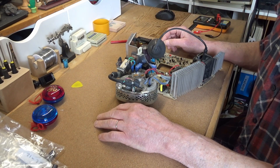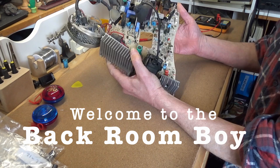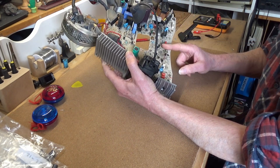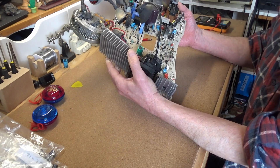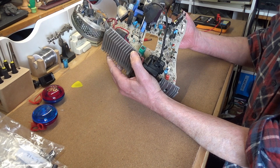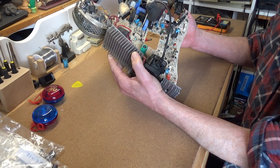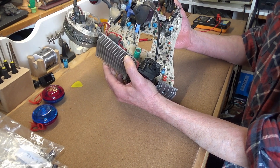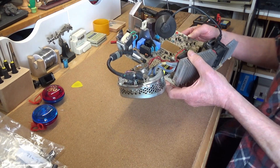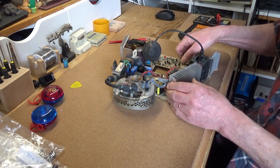Hello everyone and welcome to the back room. The last time you saw this G3, I had removed all the electrolytic capacitors from the PAV board, and I had decided to replace all of them — many were marginal, one or two are okay, but it seemed to make sense to replace all of them. However, I only had about half of them in stock, so I ended the video while I waited for the rest. I have those now.